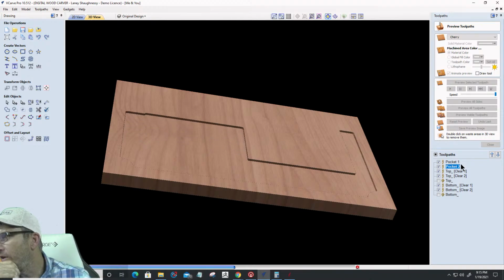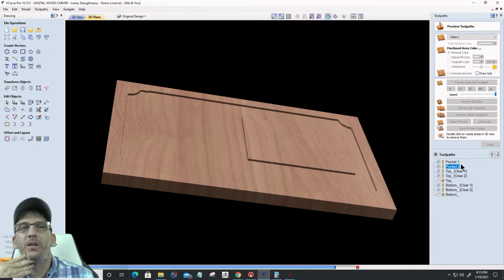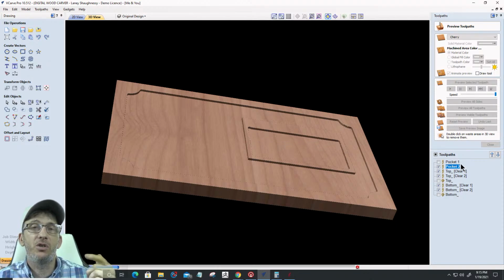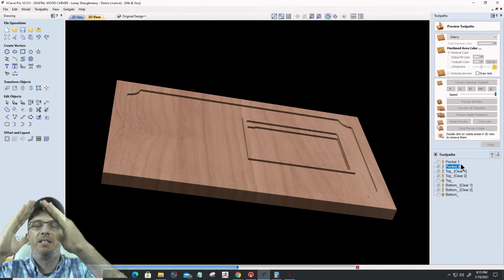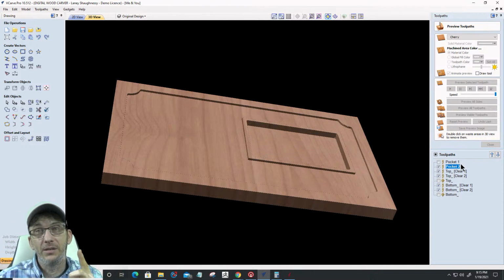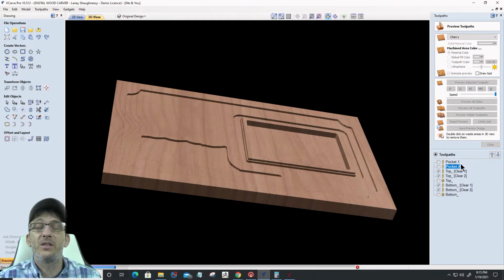Recut the vector with a regular end mill last. Yeah, Tom, I could do that. I could recut the vector with a regular end mill. I could kind of pocket it down and everything. Or I could just do a V-bit with an 1/8 inch cut depth as a profile cut to create the rest of that angle, right? An offset. But I would run that first. That would be the first toolpath to create that angle. I think that's what I'm going to end up having to do.